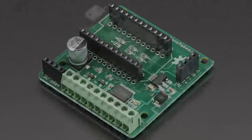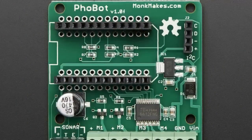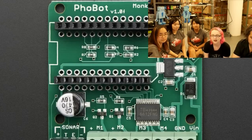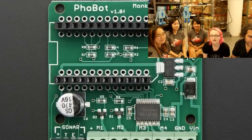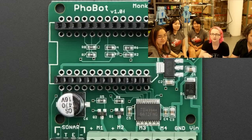This is the robot board from Simon Monk for the Particle Photon, and it probably works for the Spark Core as well. You put your little Wi-Fi board on top and it gives you a motor driver — a little TB6612, 1.3 amps. Not really enough to drive your gigantic 250-pound robot, but good for a little robot, a mini bot, featherweight class. It also has a regulator, protected input, level shifters, and breakouts. It's a little robot-builder-friendly board, good for making Wi-Fi bots.